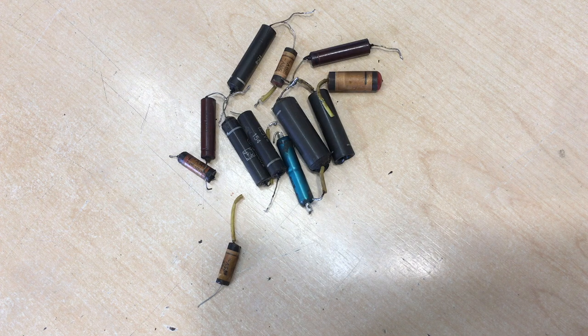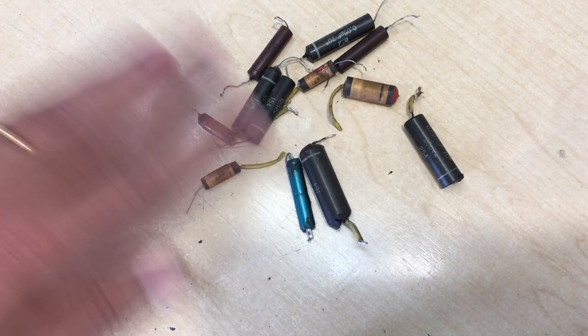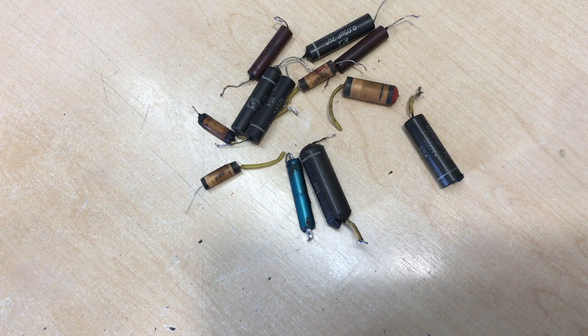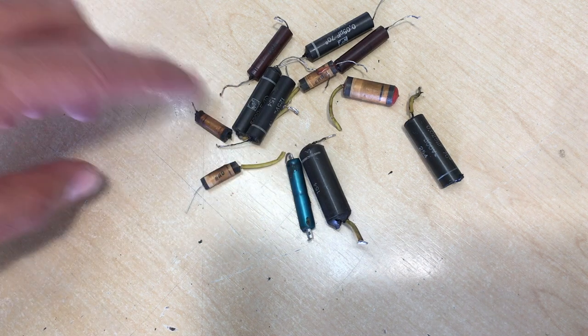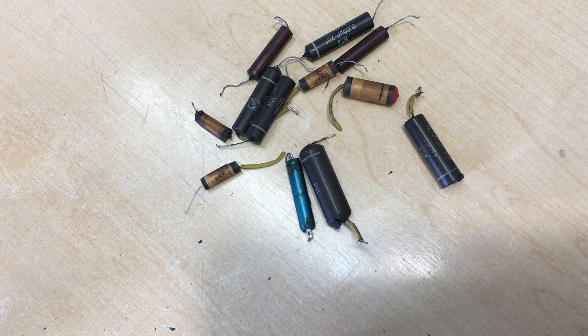This is the result of quite a few hours of work. There are not that many capacitors to swap over here, but the ones that you do need to swap over, you have to do very, very carefully. And they were all in very, very bad shape. I tested a few of these — the value is way over, the leakage is something astronomical, which is to be expected. This thing's from 1953, I believe, so it's been around for a while.